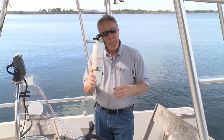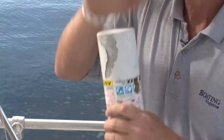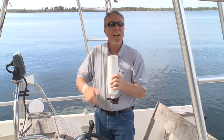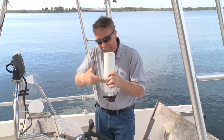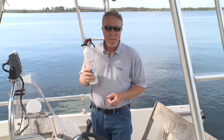Finally, monthly, you should take your fire extinguisher from its bracket, invert it, and tap the bottom several times. That prevents the firefighting agent from caking up inside the fire extinguisher. Again, the whole point is having this thing ready if and when you need it. For Boating Magazine, I'm Kevin Falvey.